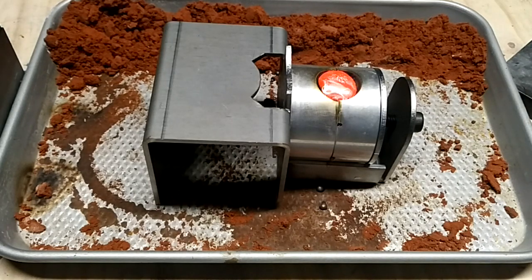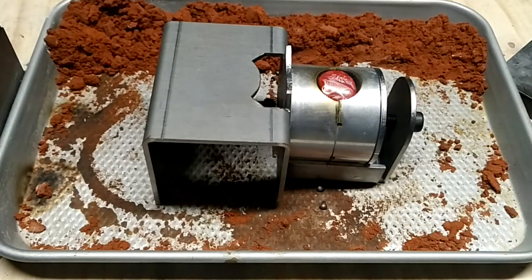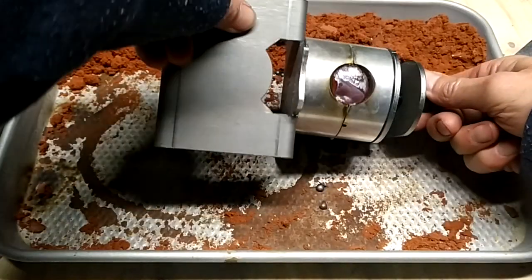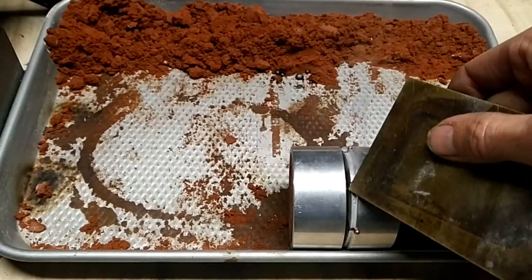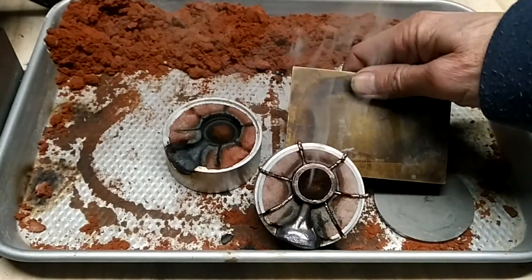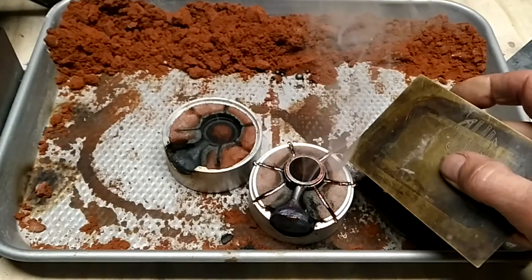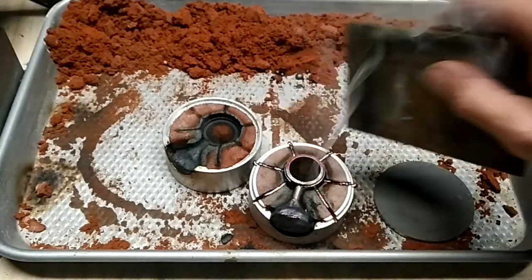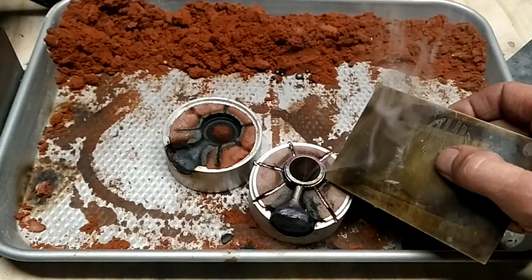So this was the sand casting of this band here that I carved. I'm going to pull this pretty quick — it's going to be hot — but I want to see what we've got here. I would say that is an excellent casting. In the future we could go with maybe a little finer vent so we don't get quite so much metal coming through, but these will be really easy to cut off.